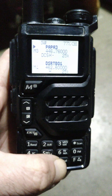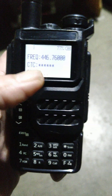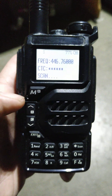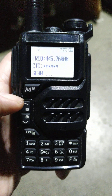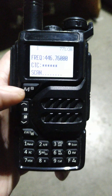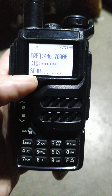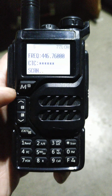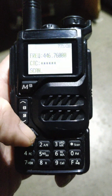Another cool function — let's go back up to the repeater. If you hit F and then star, it'll actually scan for the CTCSS tone. So if you're traveling and you hear chatter on a frequency and you want to join in the conversation, you can simply hit F and star and it'll go into scanning mode. When somebody keys up, it'll tell you what that PL tone is. Unfortunately, there's nobody talking on the frequency right now.